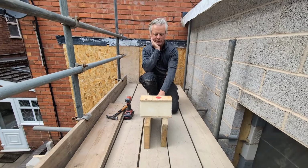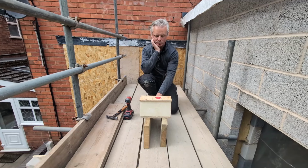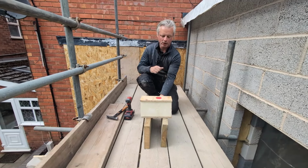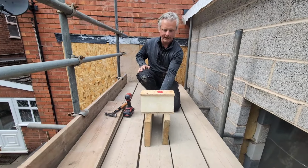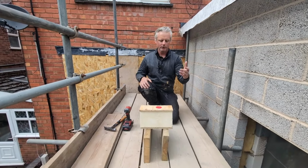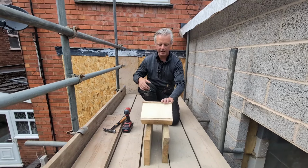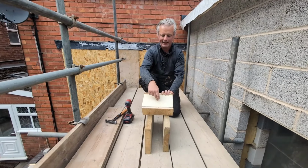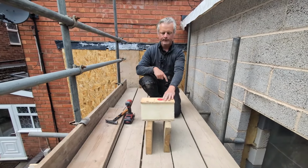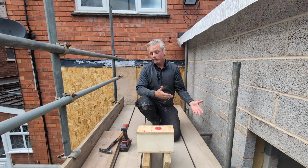We don't think we've missed any rafters. So as I say, the gap between the rafters has got uncompromised vapor barrier through the entire build here. Yeah. Again, 150mm insulation, without broken fixings on top, any air, any moisture is only going to get to about there, not to the very top. What more can we say? What more can we do?